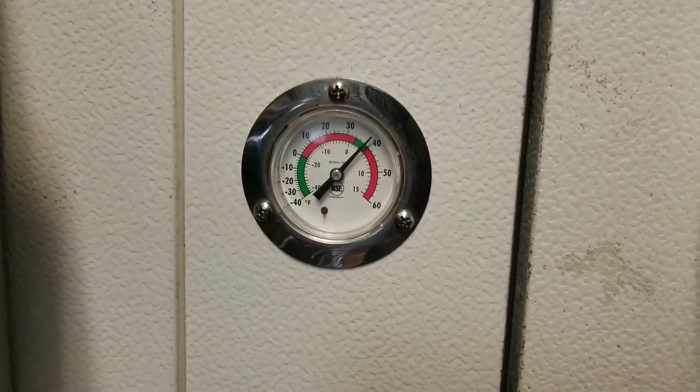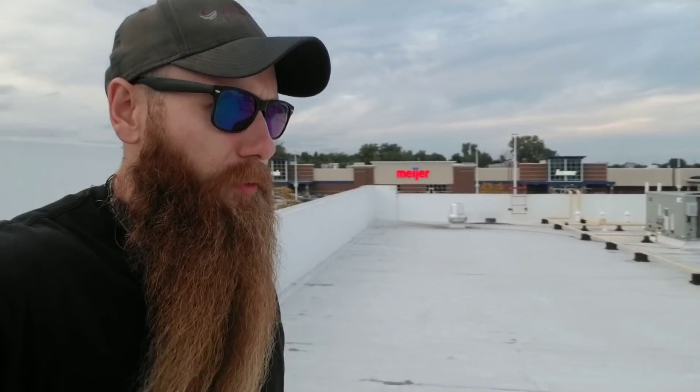Looks like we've gone from 60 to 35 degrees — we are back in business. Our temperature was down to 34, 35 degrees, right where I want it to be. I swept the evap coil and didn't find a leak anywhere. I don't know if there's maybe just a little tiny leak because I only added about eight, maybe ten ounces of R404A to the system. It's possible we have just a little tiny leak that I couldn't find with my leak detector. Tonight isn't the ideal time to be shutting down their walk-in cooler and doing a very in-depth leak check. I'm going to quote to return one day and shut down their walk-in cooler and do a more in-depth leak check of that coil just to be safe. And if they choose to deny that quote, well, that's on them.